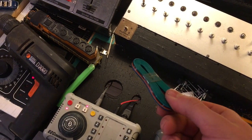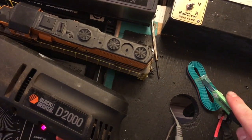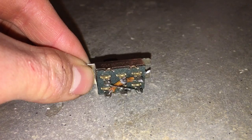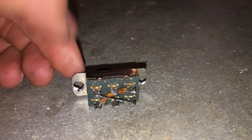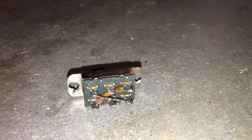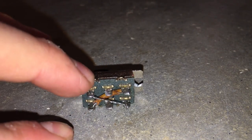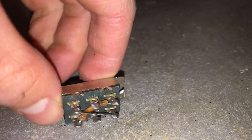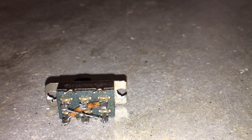To wire this thing up, we're going to use this wire — it's actually multiple wires, five of them. This right here is the back of the switch, and the design is actually genius. The switch has two inputs which are the outer ones, and one output which is the middle one. Without this little crisscross wire you would need two input wires to reverse the polarity. What this does is, if you flip the wires around, it reverses the polarity already. So you just need to connect two leads from your power source — it flips them. Set one way it takes the reversed power and puts it out; the other way it takes regular power and brings it out through the middle.